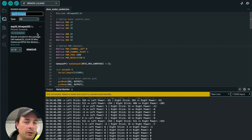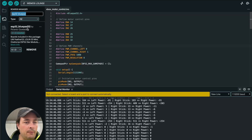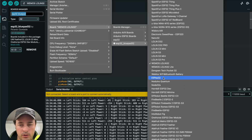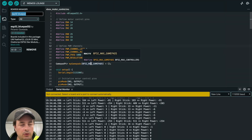BluePad is the library used to connect the ESP32 to a Bluetooth controller. It supports a range of controllers — a PS4 controller should work fine, for example. Go ahead and install ESP32 BluePad by Ricardo Quesada — very kind of him to make it, it makes our life much easier. Then go to Tools, then Board, and you should see a new ESP32 BluePad option. Find your specific board — mine is a WEMOS LOLIN32 — select it, and you'll have all the BluePad libraries available when you deploy.